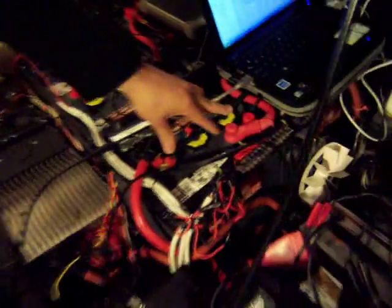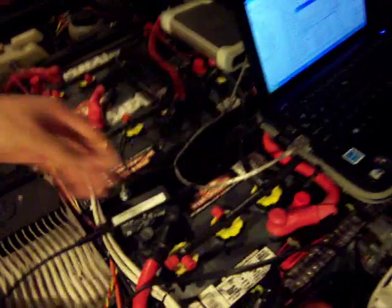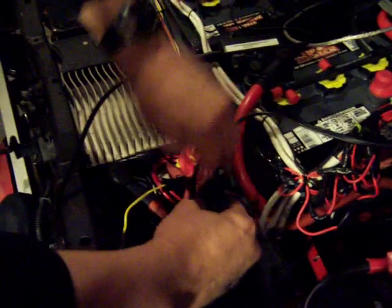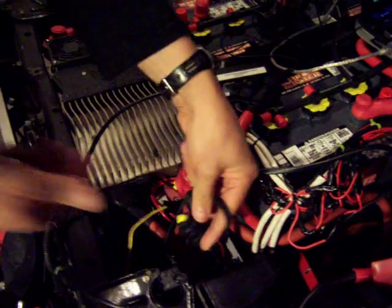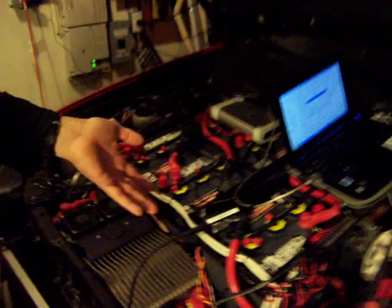You remember the original caps that were leaking all over the place — I had to replace them and buy a remote watering system. My main idea was to stop the acid leaks from getting out of the battery. These connections are for the remote watering system: you plug in the connection and push a little valve. This also makes watering the batteries much easier. It also stopped an additional problem I was having — a fault to ground issue. When I replaced the caps, I realized the leaking acid was causing the ground fault, and I don't have that problem anymore.